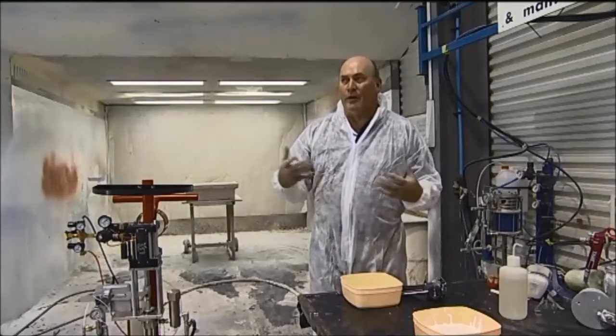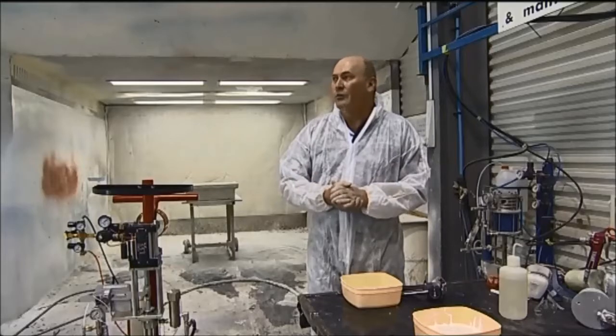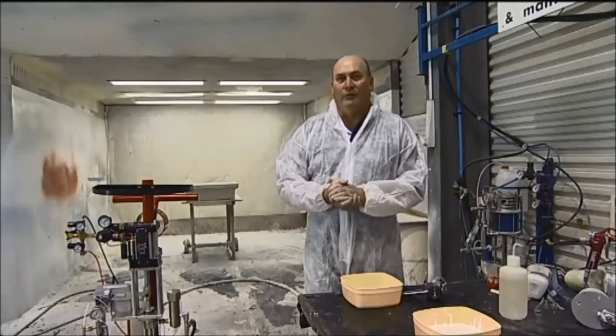So a lot of parts like fridges and other metal products can be manufactured and then post-finished, as in painted. Instead, we can actually start with the finish in the mould itself. So when we do our moulding, consolidating laminates, and pull it out, we've got our finish.